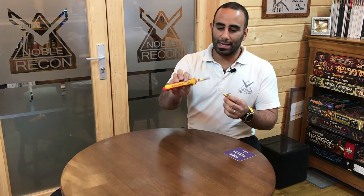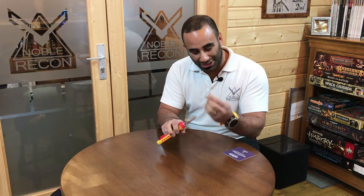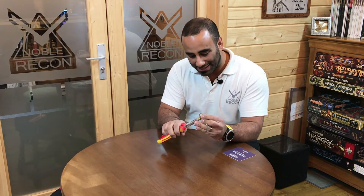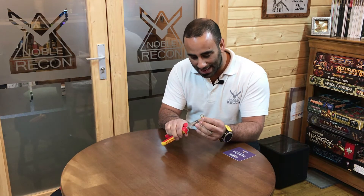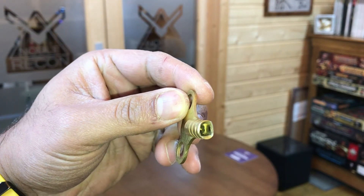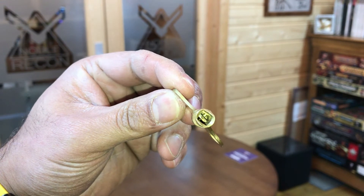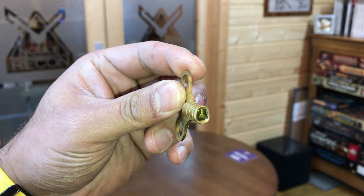I've got my radiator key, and all I'm going to do is take a pair of grips and just gently — because it's quite soft metal, so the cheaper your radiator key, the better — just gently nip the end and try and squeeze it in a bit, so it's going to compress. There we go. You can see that it's slightly deformed, but hopefully that's going to clamp on the valve now.